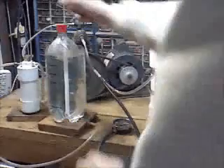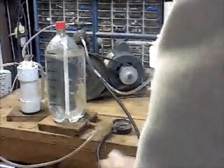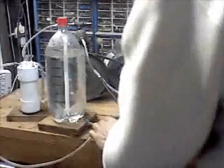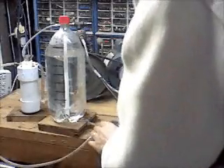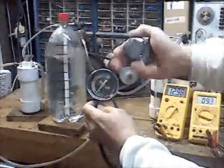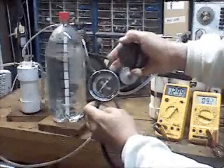The pump is running. The cell is going nuts. And I'm going to have to hurry. Here we go, stopwatch is running. With the volume of gas being produced, I'm only able to maintain 24 inches of mercury.